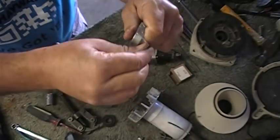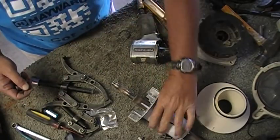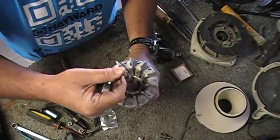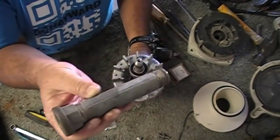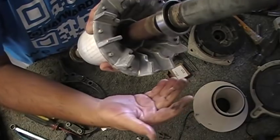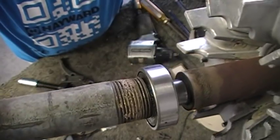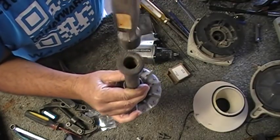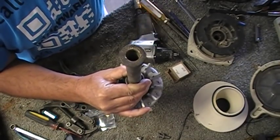There's a new one. To put it on, just make sure everything is clean. I like to put just a tiny bit of grease lube on it. Use a 3/4-inch galvanized or 1/2-inch galvanized — just go down and hold it centered. Don't let it get off to the side. Just keep it centered; you don't want to damage the ball bearings.